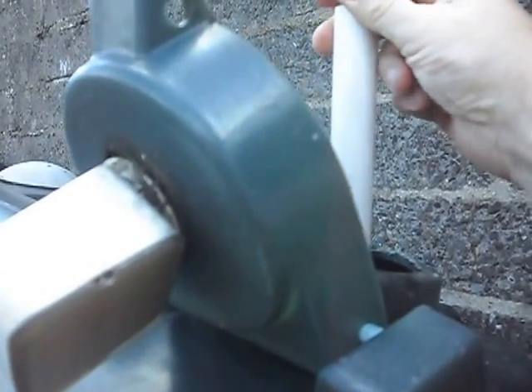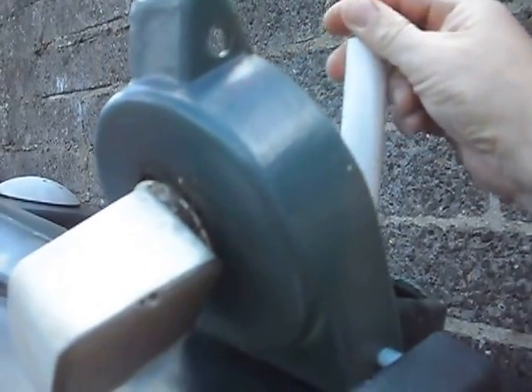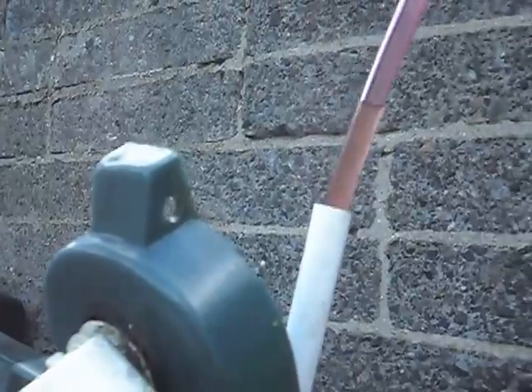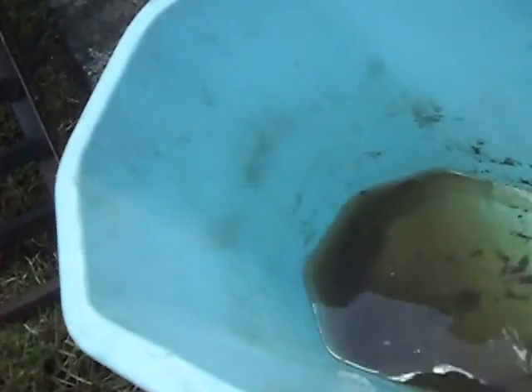Because the water is heavier than the oil, what you are doing is pulling the water that builds up in the tank out. See the water and the crud — then just empty it into the bucket. There is about 10ml of oil there and the rest of that is water.